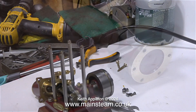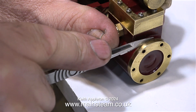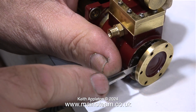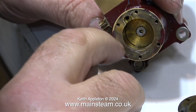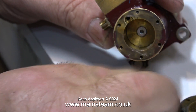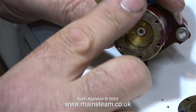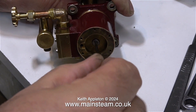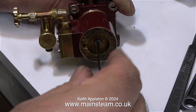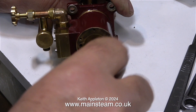Not just to look at the gland problem — I'm also going to change the piston ring, because from what I can tell from the sound and feel of this engine, which has negligible power, the piston ring is worn out. When I removed the cylinder head I noticed some sealant; this could be the latex type which is acceptable. I broke the seal using a very sharp craft knife, then used an allen key to remove the bolt that holds the piston to the piston rod.